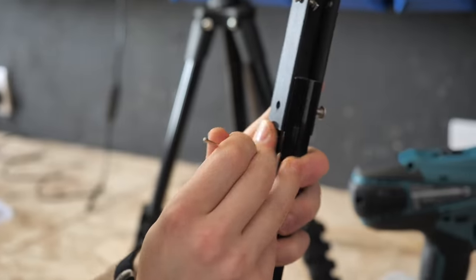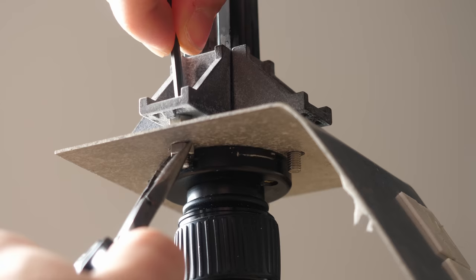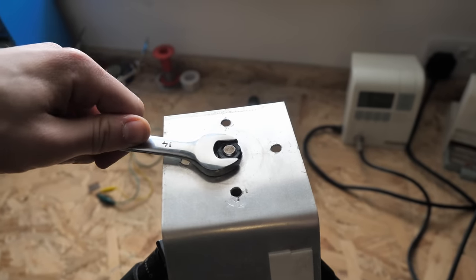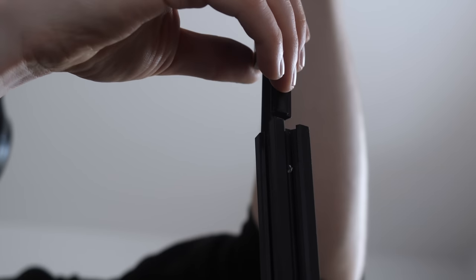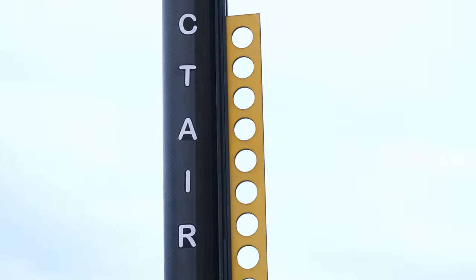We were all excited to see the rocket launch, but as we were setting up the launch rail, I realised that the 3D-printed part connecting the two one-metre launch rail sections together was not strong enough. My flatmate Sam and I tried to quickly hack together an aluminium version of the bracket, but it wasn't strong enough and we had to scrub the launch — one length of rail is just not enough for a two-metre long rocket. Over the next week, I rebuilt the launch rail to be far stronger to take the three-kilogram mass of the 2.4-metre tall rocket without wobbling.